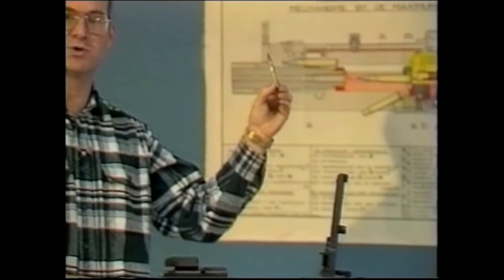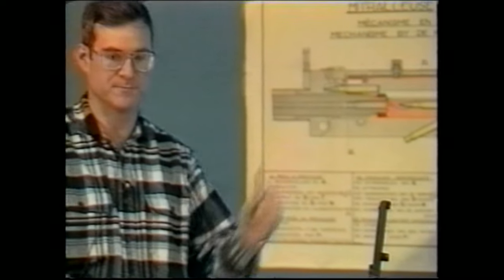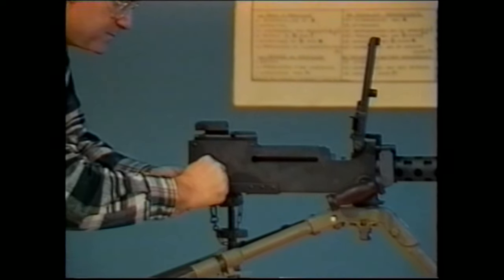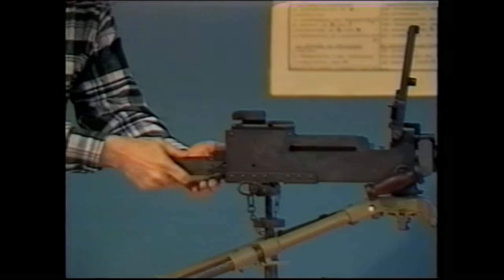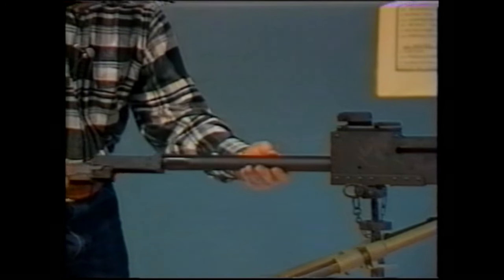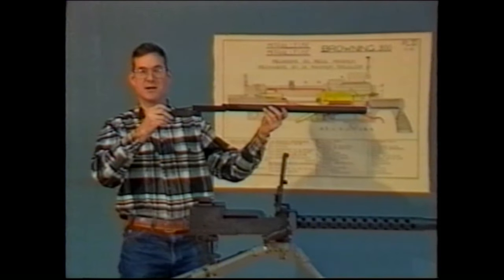You can use a cartridge tip. This particular gun was designed to be able to be dismantled with a cartridge. Whatever you use, you'll have to press in on the latch pin and withdraw the barrel, lock frame and barrel extension from the rear. The entire assembly should remain intact.